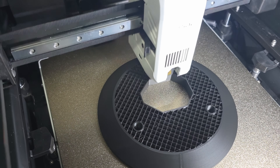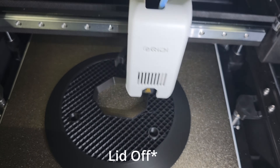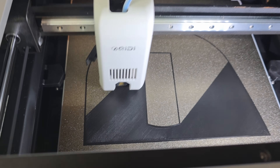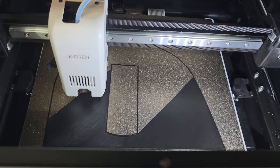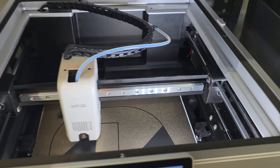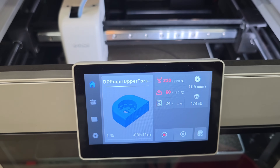When it comes to printing results, I probably could have gotten them a little bit better by slowing down the printer and opening the door, because I had a tendency to just leave the lid on. Opening the door and letting some more cool air in probably would have gotten a lot cleaner finishes on some of those PLA results. So I think if you bought this 3D printer, you'll have a lot better results than I did with PLA, because I just like to leave stock settings.